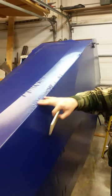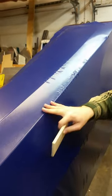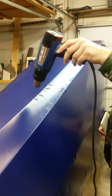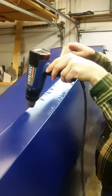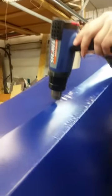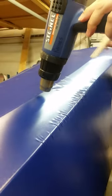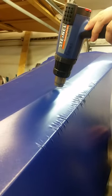You can accidentally trigger the glue under the wrinkles without fully finishing it — like here it's triggered and glued, and here it's triggered and glued. You can't accidentally go like this, trigger the glue, and have it fill the voids of those wrinkles. So you have to go after the wrinkles, shrink them here and there, and then in one go melt the glue underneath, shrink it tight, going slowly. Make sure you're not forgetting a spot and accidentally triggering the glue there.